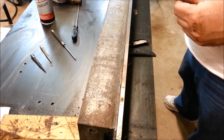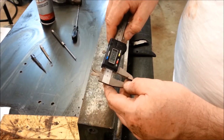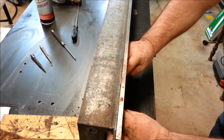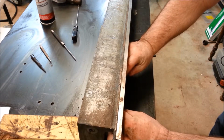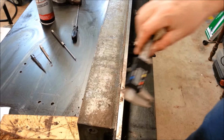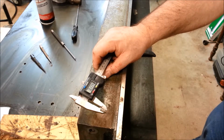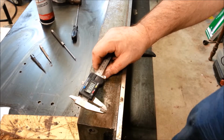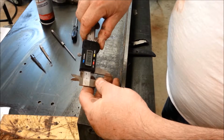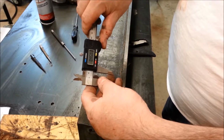Now I notice that the top of the hole to the top of the bed is about .450. And I'm going to measure carefully the diameter of the hole, which, as I remember, was about .170 some. .174. So half of .174 is, let's see, half of 160 would be 80, plus half of 14 would be 7, so 87 thousandths. So I'm going to go to .450 plus .087, so that would be another .037 on .500, so it would be .537.